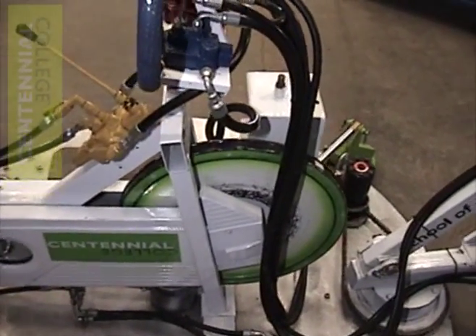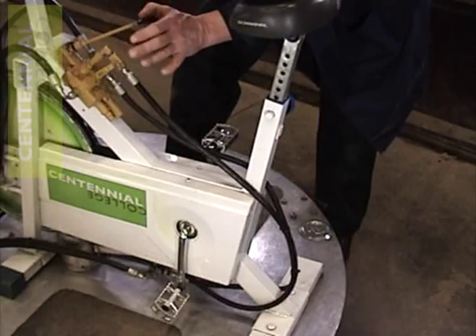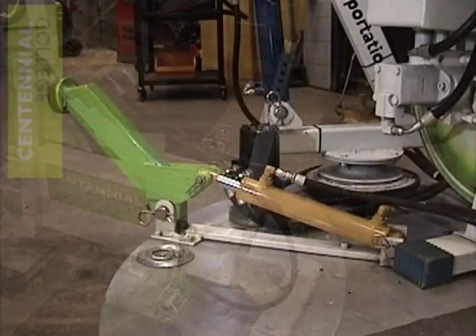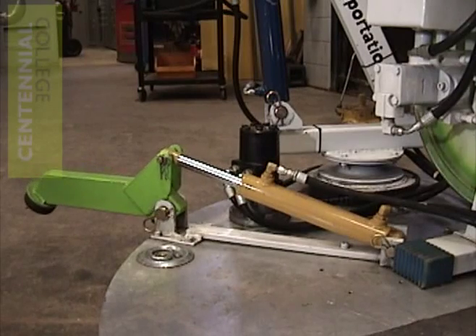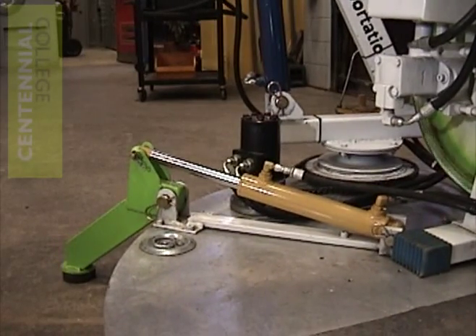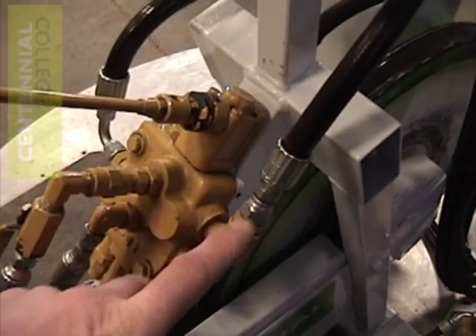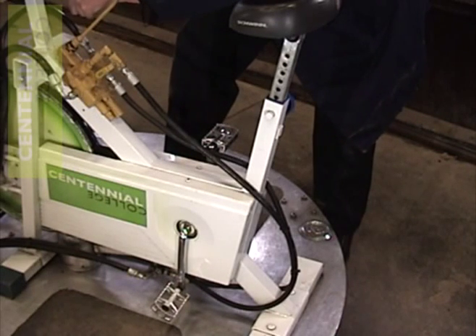To do that, we fabricated a couple of outrigger arms. We installed two 2-inch cylinders connected in parallel. There is a leg at each side of the front. When we pull the valve one way, we redirect the pump oil from the output part of the pump to the barrel end of both cylinders. The leg with the least amount of resistance always starts to move first. Only when they both feel the resistance of the floor at the same time does the pressure start to increase, and only when the pressure increases to about the same value as the weight of the machine divided over the area of the piston does the machine start to lift off the ground. The pressure increases quickly until it exceeds the value of the relief valve. The relief valve directs the oil to the valve output port, but not before providing enough resistance to flow to build the pressure to 750 PSI. The operator is now expected to release the control handle, which allows the oil to get to the output port unrestricted and therefore not able to build up pressure in the circuit.